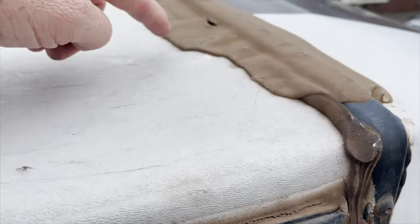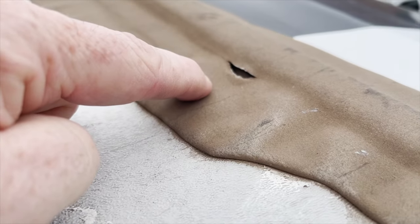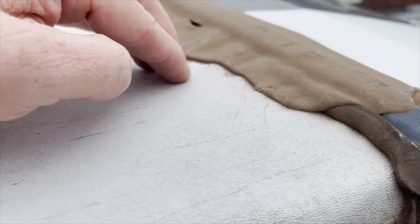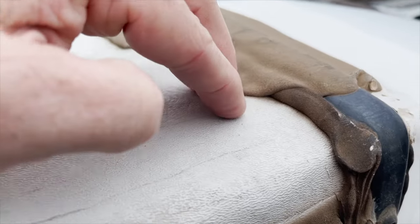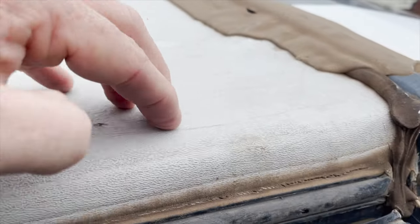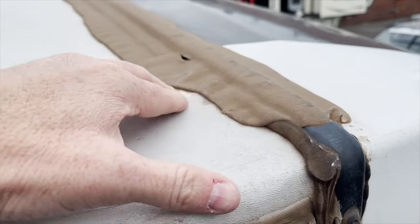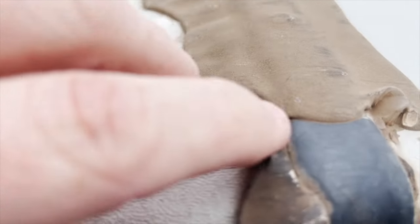While we're up here on the roof, there's a big pocket here — it's actually a bubble where it's torn loose. You can see the rubber material is lifted in this area because it's glued in place. Where it's nice and tight versus soft here, the wood's not bad but water's been getting in and causing damage to that area.